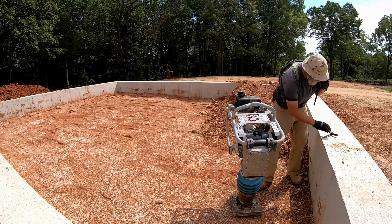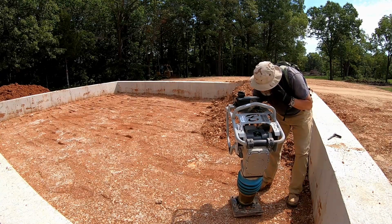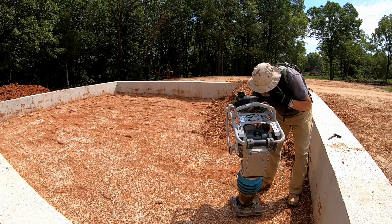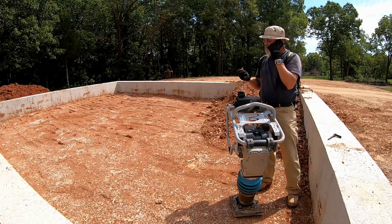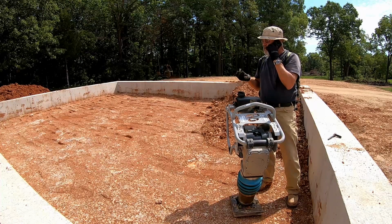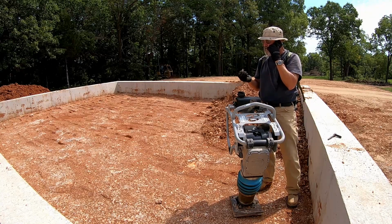It'll hit about 2 combustion cycles and then die. And it smells like it's flooding out. I'm trying to get the plug out of it now to see if it's wet. It's not wet, but it's black as can be. I don't know. And it's a teeny tiny one that I don't have any of.